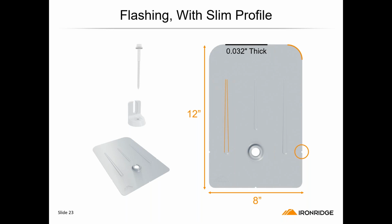While some manufacturers are moving away from flashing, FlashVue offers a more reassuring path. A narrower flashing for less interference, but it's worth mentioning again, still 12 inches long to penetrate that third course of shingles and protect the roof along the way, which manufacturers require. Just for comparison, FlashVue 2 is 0.040 inch thick.